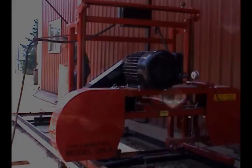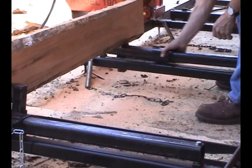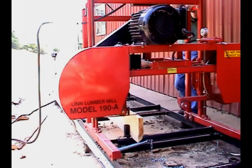When the log is being squared up, unedged boards are created, but they can be finished by putting sawn edges on them later. This edging process can be done individually, or several boards of similar size can be done together. If the board already had one good edge on it, you're done. If not, it simply needs to be turned over and reclamped and the second edge sawn.